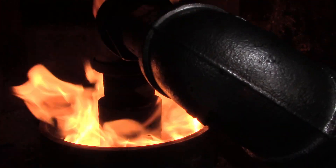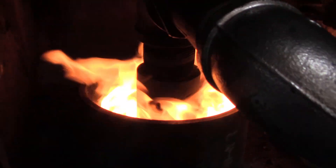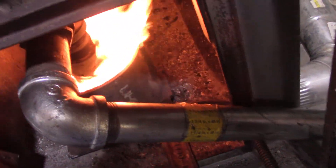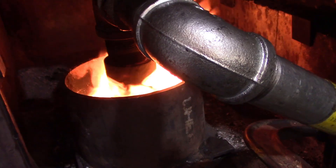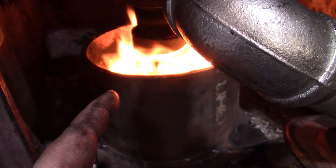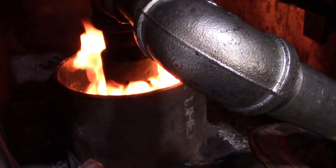I put a bunch of holes around the top as well for a secondary burn, but I'm not getting the burn over there on those holes so I think it's just uneven. I couldn't get it to go blue like with the air compressor, but I realized the compressor uses finer nozzling and that creates a harsher jet even though I'm flowing a lot less. So it creates a bunch of turbulence. When I introduced a lot of air with a smoother flow I had terrible burn, but when I introduced airflow that created turbulence within the swirl I started getting a much more aggressive, hotter flame and eliminating all smoke.